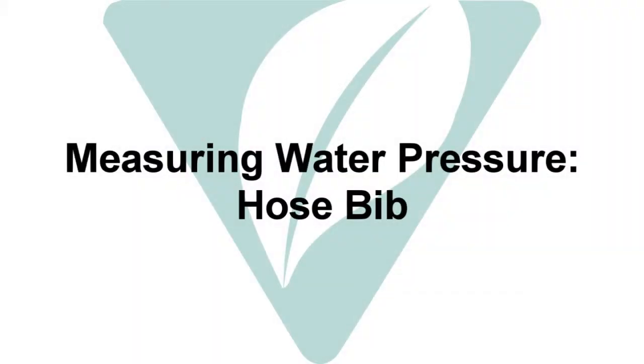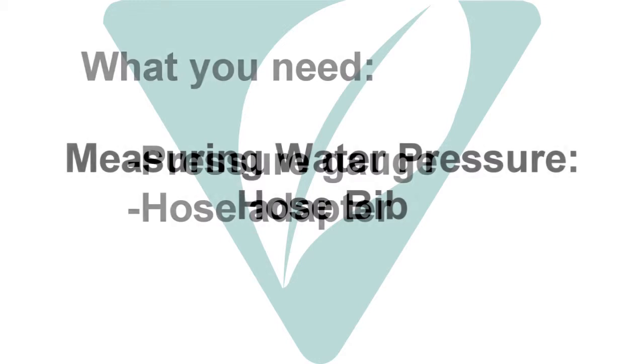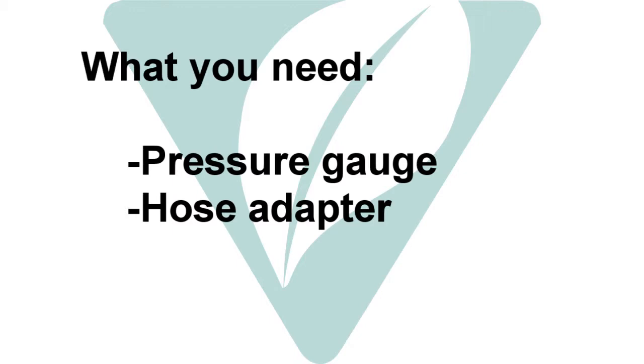A typical place to measure water pressure is at a hose bib. Be sure to find a hose bib before the house pressure regulator. You will need a pressure gauge and a hose adapter.